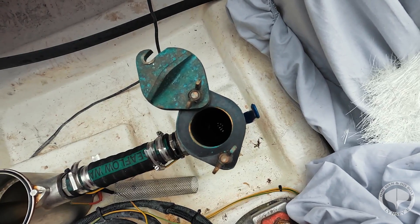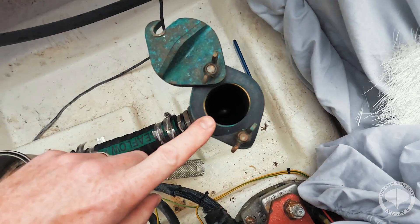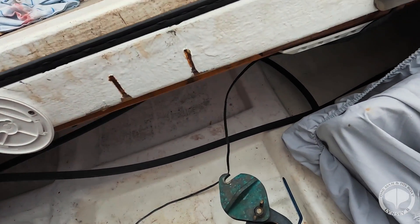You can look underneath the boat, look up through, and look at the daylight to see if there's any debris actually in the seacock itself. Then all we have to do is close the seacock, fill it with water, and go outside the boat to see if there's any weepage. If there's weepage, there's a problem with the ball valve. Certain types of valves can be a bit sticky — just keep testing them, open them up, close them off. I do this every single time I use the engine: once I'm finished, the ball valve gets closed; before I use the engine, the ball valve is open. Simple as that — it's just part of your daily routine.